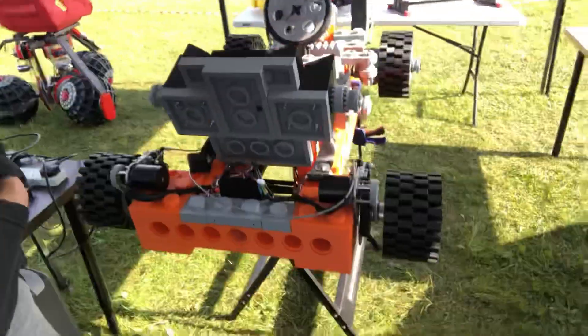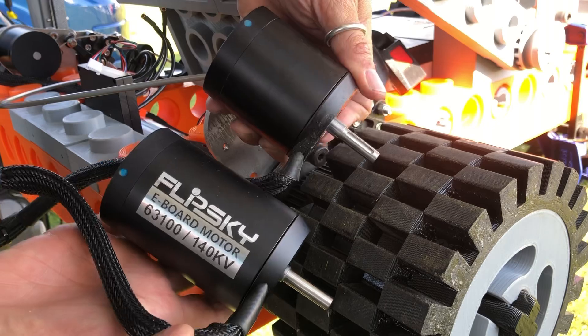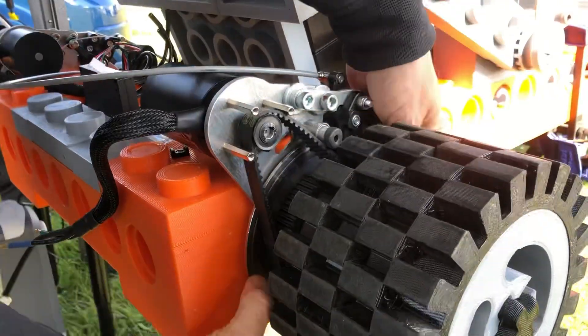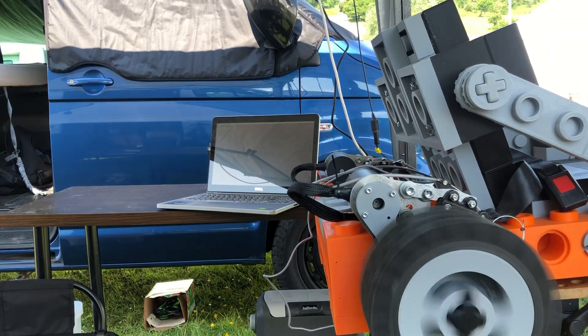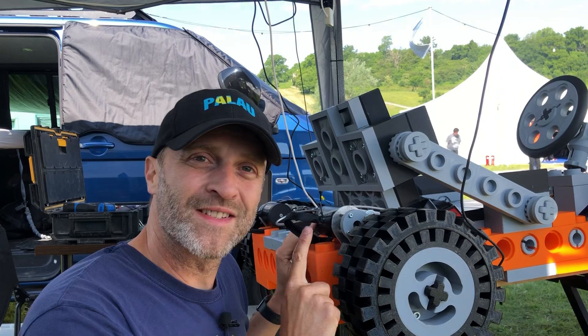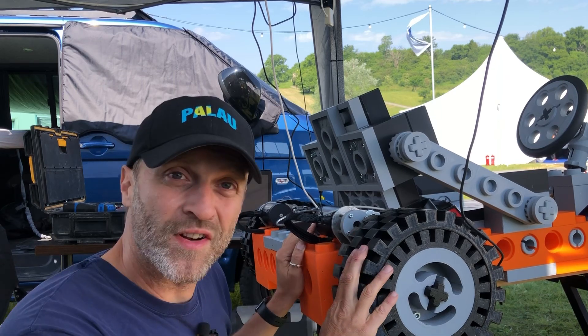It's day two. Now that I know I need the larger tyres for greater ground clearance, I'm definitely going to fit the torquier motors. Let's get them fitted, tuned up, and try it all again. If you're interested in any of the FlipSky components — such as the 63100 motors or the 75100 controller — I'll leave a link in the description. The bigger 63100 motors are now fitted and tuned up. I've currently got them limited to 70 amps, with 100 amps available. The new bigger wheels are back on — now let's see if there's enough torque.